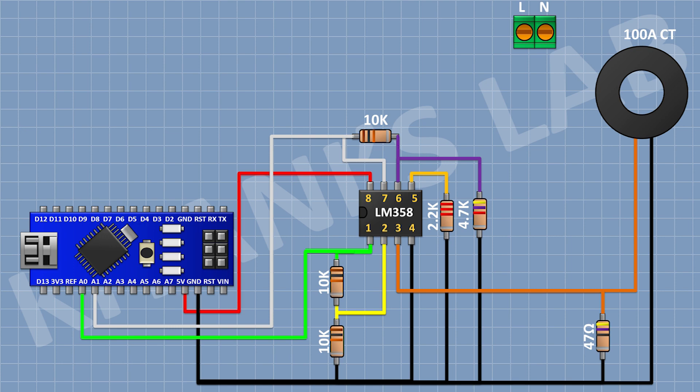After that I'm gonna connect a 470K resistor and connect its one pin to pin number 5 of the IC. After that I'm gonna connect another 470K resistor to the remaining pin of the previous one, and then another 470K resistor chained similarly, with its other pin connected to the line of the AC supply.